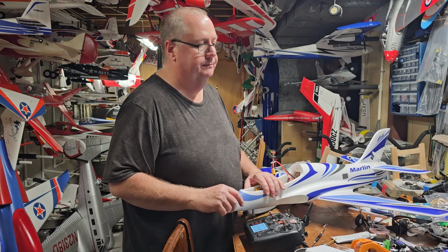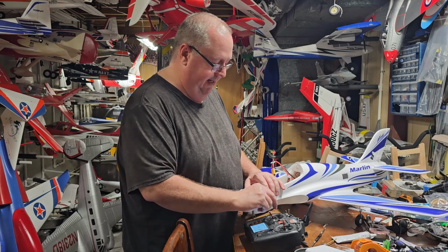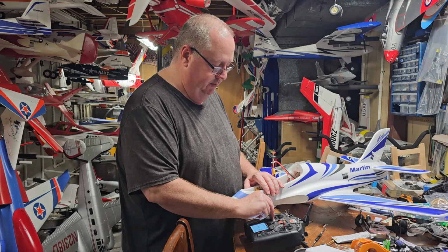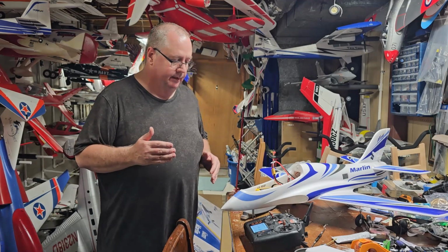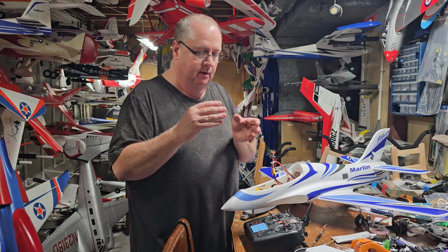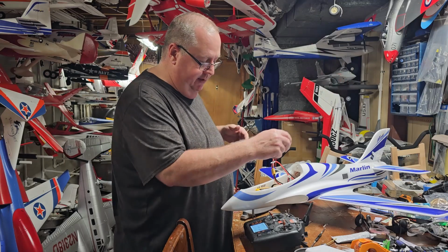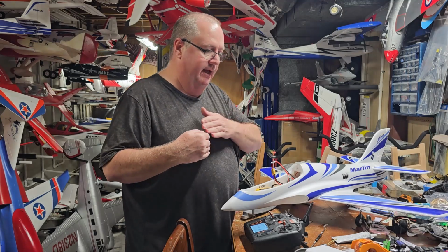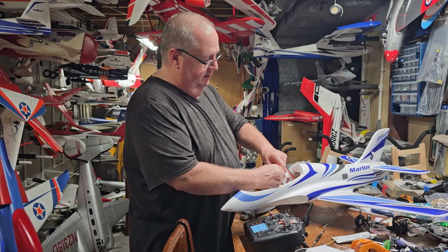Now I'm going to drop it. Now, I should have immediate thrust response. And I do. That's a properly calibrated ESC. And why I had it all the way forward is I have to go into programming mode. It captures the highest or 100% throttle, and then I drop the throttle down to 0, and it captures 0 throttle. That way it knows where its range is, and that's the purpose of calibrating your ESC.